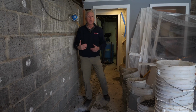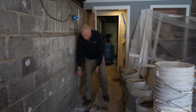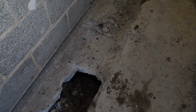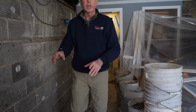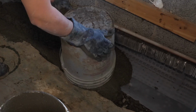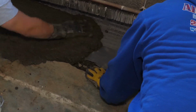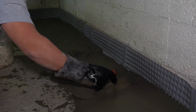That's the one that's really involved in the structural integrity of the foundation, where the wall is being supported, and this needs to be kept intact with the main body of the floor. So we leave what's called an engineering spacer or an engineering tab right here, and as we make our trench, we're going to continue and do another engineering tab periodically around the foundation to keep the structural integrity intact. And then we're going to pour back the full thickness of not only the underneath floor, the second floor, but the one on top also, and finish it all the way over so that everything supports each other, so that the floor and the walls and the footing are all united and working together.